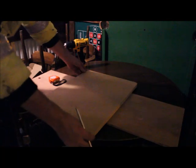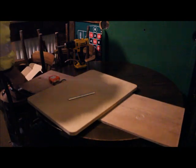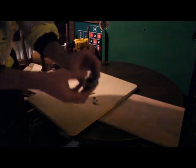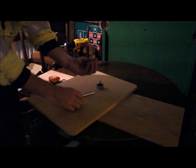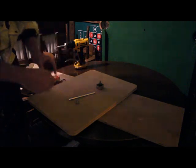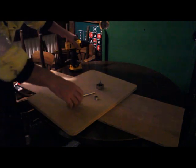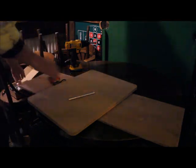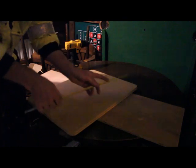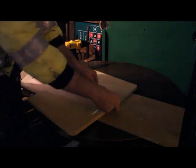Okay, I've got my door here. Basically, after lots of careful measuring with the push clasps and these bits here, I've discovered this is a 20mm gap. So I've got a 20mm Forstner bit in my drill. I then, with some careful measuring, measure down halfway, and then after playing around to see how far the clasp is going to come out, measured in this way.